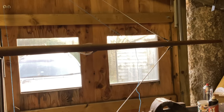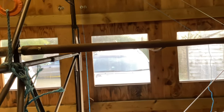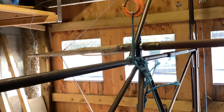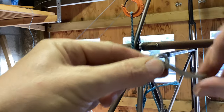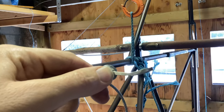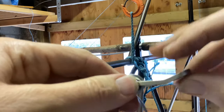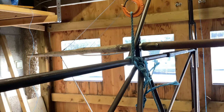Now the string's on, I can take the bracing wires off. I'll take the lower ones off first. The good news is the wires all fit. The cable tangs need bending ever so slightly — the top ones need a little bit more bend on them. I haven't done it up tight; it just needs another couple of bashes. The lower ones are almost there. I'm going to tweak them as I go. When I did these original wires there's a lot of adjustment, and whilst the bend was pretty good, because of having that adjustment it didn't actually matter if the bend wasn't exactly right — well, it does now. So I've only just got to take the through bolt off on each side, give the fittings another bash in the vise, and try them on again.